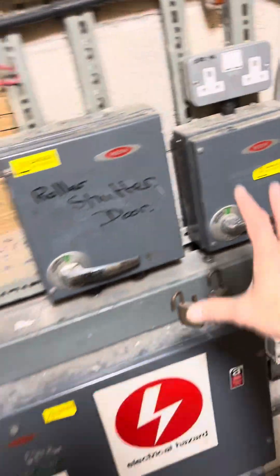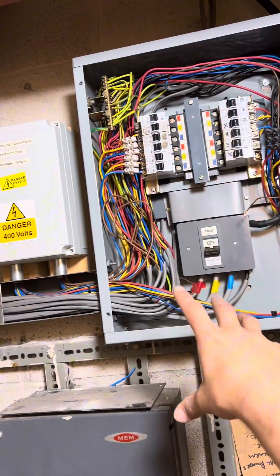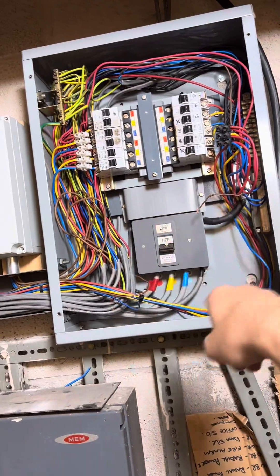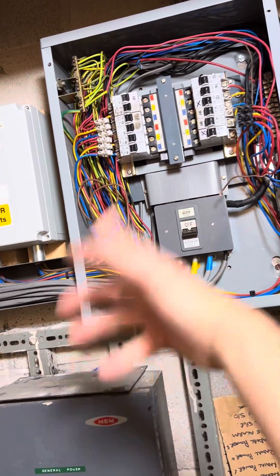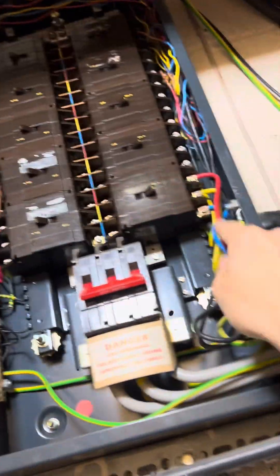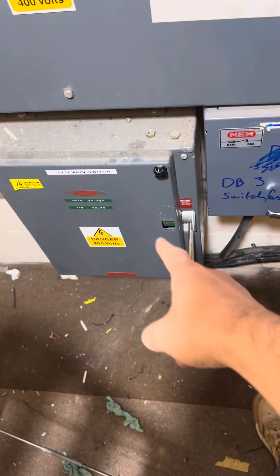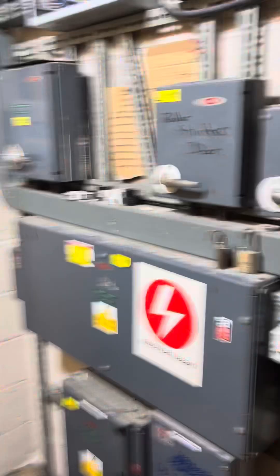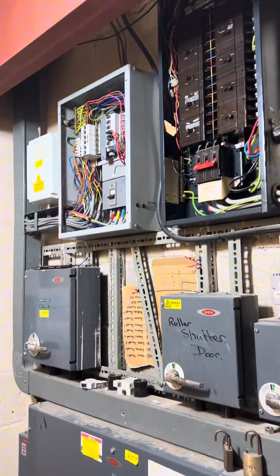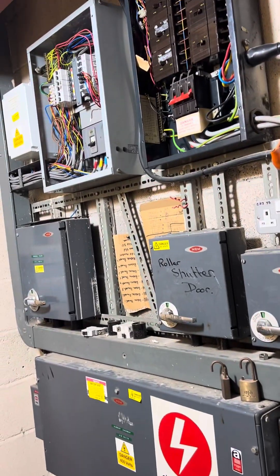All this is staying. I think the plan is to perhaps remove all this — it's all unused — and we're amalgamating these two consumer units into one. But a lot of this one is lighting by contactors, so I need to figure out what's what. It's going to be extended into a new Hager board. In this fuse board, it's only that one circuit that's staying, which feeds another board somewhere. I'm also going to reduce these fuses to 125 — I think they're 200s at the moment. It's 10 o'clock, I've had a cup of tea. Let's get stuck into it.